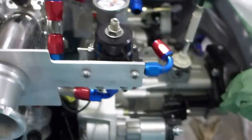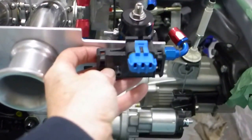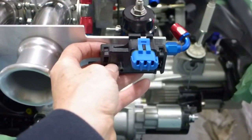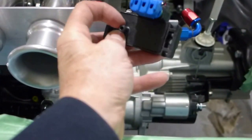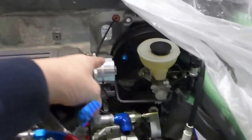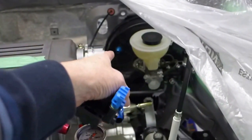And I'm just modifying some things so that I can fit everything on one end here. So basically on this end here, where I've got the fuel pressure regulator mounted now, on the other side, using the same bolts and a little bit of a standoff, I'm going to mount the manifold vacuum sensor. And then this port here and this port here go to the vacuum plenum. The brake servo has got a number 6 AN fitting, and that'll connect to the end of the vacuum log.